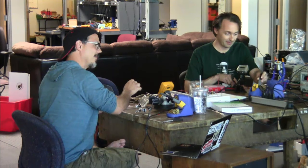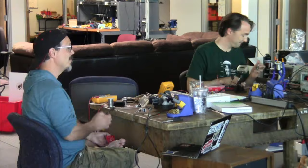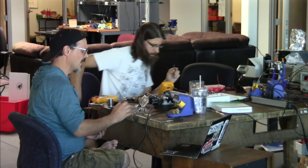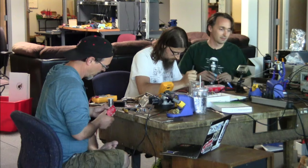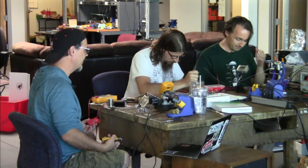Pete, there is a question about your audio kit. Sorry. Go ahead. What is it? Why does the kit have separate volume knobs? Let me try to think back to why I made that decision. I was doing a tube amp design at the time, back in the day, and a dual audio pot, right, one shaft, two pots, in an audio taper, was expensive, and I didn't want to pay for it because I'm cheap. And I discovered that actually having it that way was kind of cool. I dug it. And so when I did this one, it was the same thing.